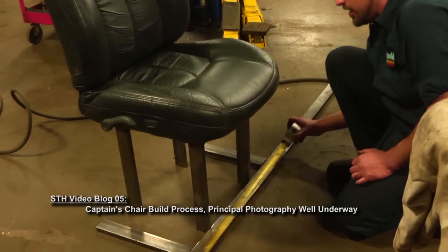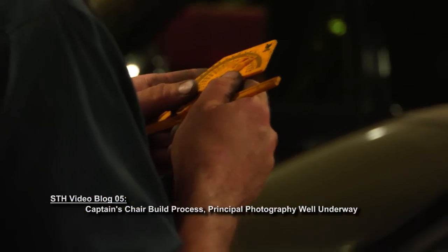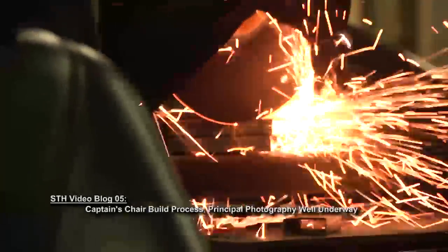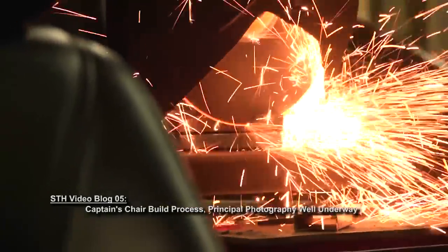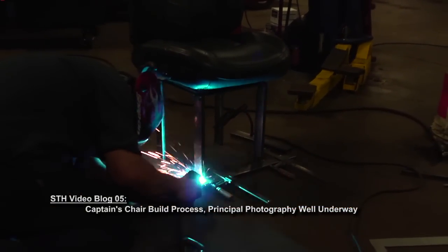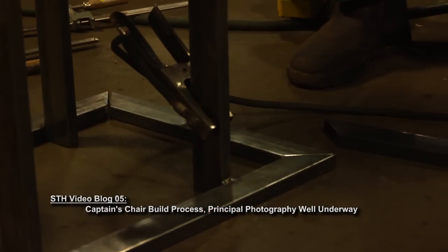When the chair is finished the sides of the base will come down on an angle. What's happening right here is measuring the metal that will go on the bottom so the corners can be mitered to fit that angle perfectly. More metal is being cut and you can see the mitered edges, and now finally welding the floor pieces in place.